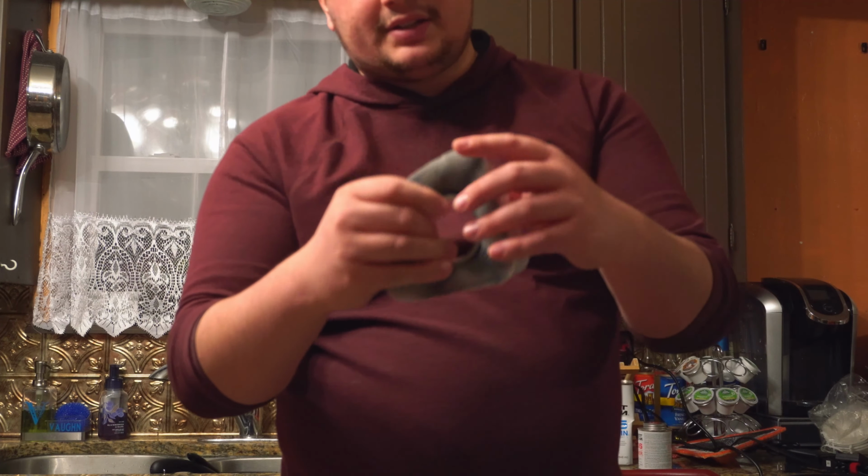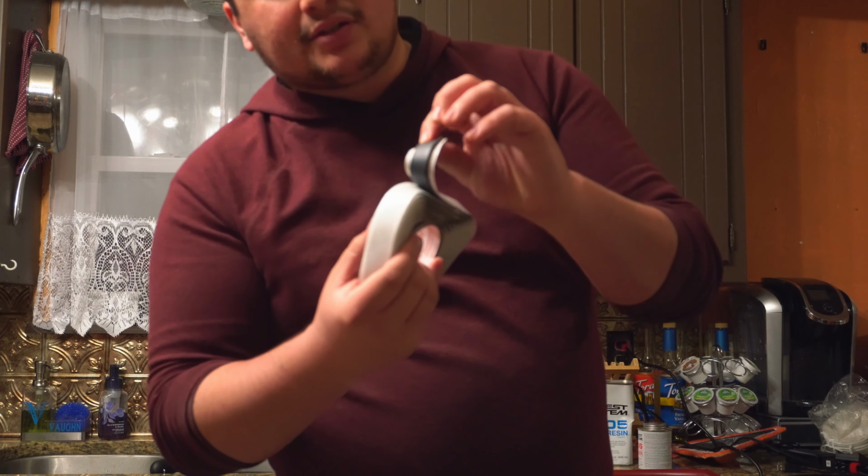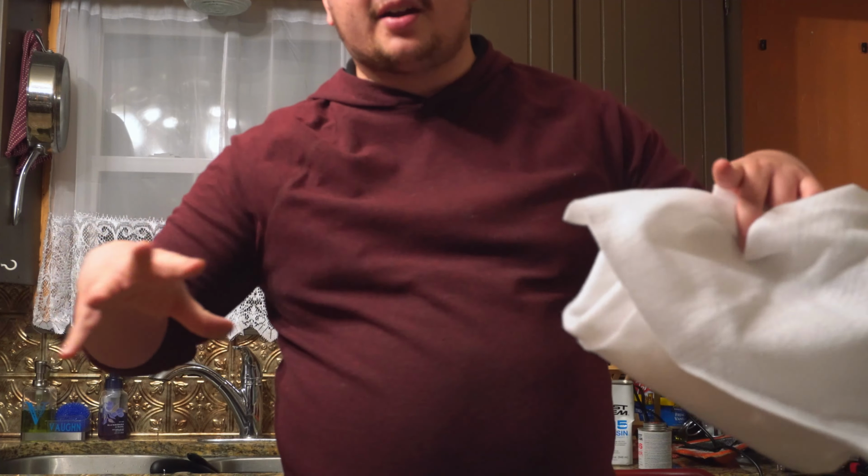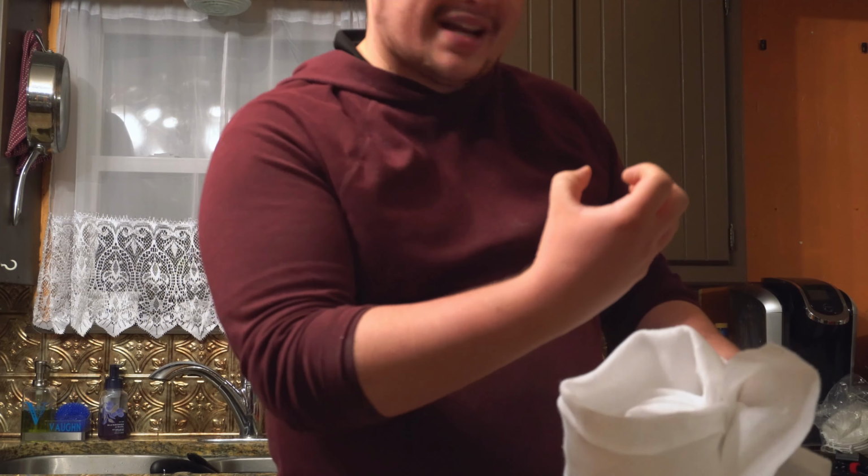Gum tape, this is, if you look at it, it has that little gray, it's super gummy, and that'll add that suction in. And then we'll add some of this cotton fabric that helps spread out the air to all the little corners of our mold. That way we get a nice suction down into the mold itself. If you want to learn more about making carbon fiber parts, check the videos in the description below. They were great references for us.